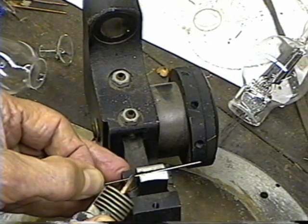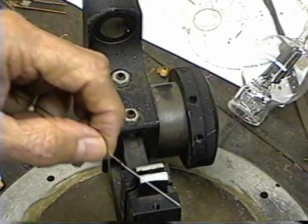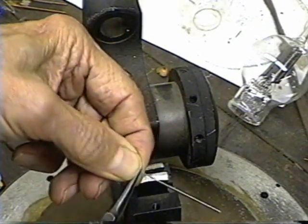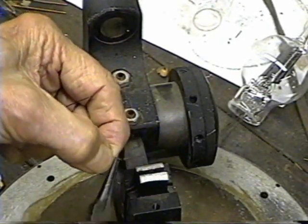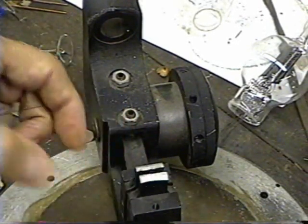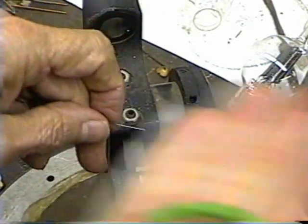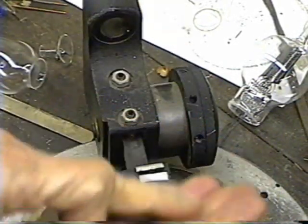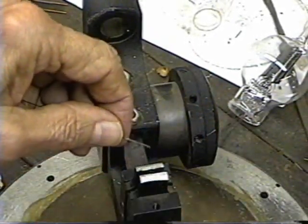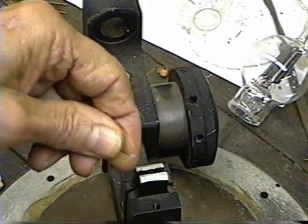We just put it on there and it's welded. Now we're just going to break that off to about a quarter-inch long. The wire is very brittle, so it breaks off quite easily. This one delaminated, so I've got to break a considerable piece of that off. Tungsten wire is treacherous and it can have laminations. If that had been in our seal, that lamination was an area where the tungsten was not sealed together — an actual crack in the tungsten wire. Air could have gone into that crack, gone through the seal, and gotten into the tube. It would have been a disaster.